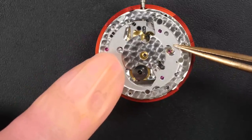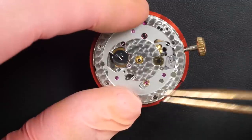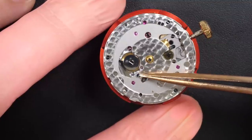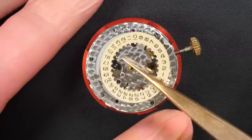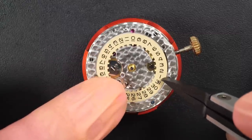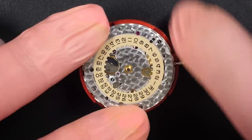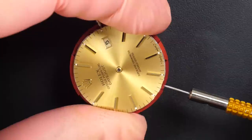Now I put this massive plate on top — you can't feel it on video but it's very heavy and very solid, that's very Rolex. The caliber metal is so solid and heavy, heavier than most calibers. It gives the watch a feel of quality. Putting the calendar wheel in position, closing the screw to keep it where it needs to stay, and checking the quick-set date — yeah, the date is jumping. Putting the dial in position.